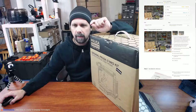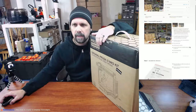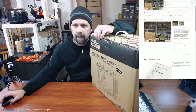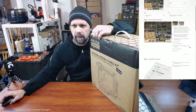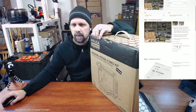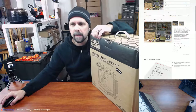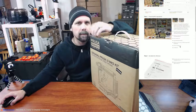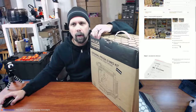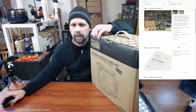the MK2S. All motors and trapezoidal nuts will be reused. The motor pulleys will be reused. The 623 bearing housing times 2 will be reused. The LCD screen, the front bezel, the knob will be different. I'll say the screen, but the front cover and knob will be different. And then the extruder springs. Now, I didn't have any instructions to print the LCD screen part, so we'll see if it works. If it doesn't work, I'll just leave it loose for now, or if I don't finish this stream today, I'll print it tonight or tomorrow. The extruder springs times 2 are gonna be reused, and the U-bolts times 3 are gonna be reused.